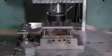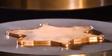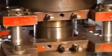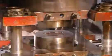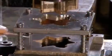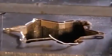This machine delivers a powerful punch to cut sheriff's star shapes from a coiled sheet of brass. They place a star shape in the steel mold of a press. It applies about 77,000 kilograms per square centimeter to make an impression on the badge. A punch press trims the ragged edges to make it look neater.